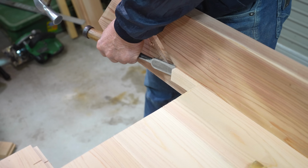I'm using 106mm wide studs for the steps and the platform. It would be better if it were thicker, but as you will see after the slide is finished, the sides will be on the outside of the platform. This means that the area people can slide on would be narrower if larger timber was used. The slide is wide when viewed from the side, so I kept the stud size as it is and made the face screen come on the sides. The 30mm thick edge would be on the front when viewing from the ladder side. Though it's thin, it's not bad.